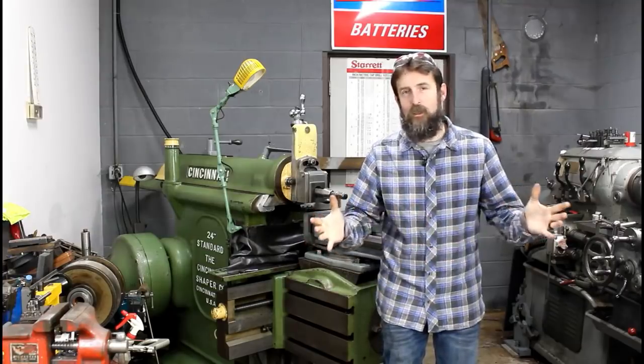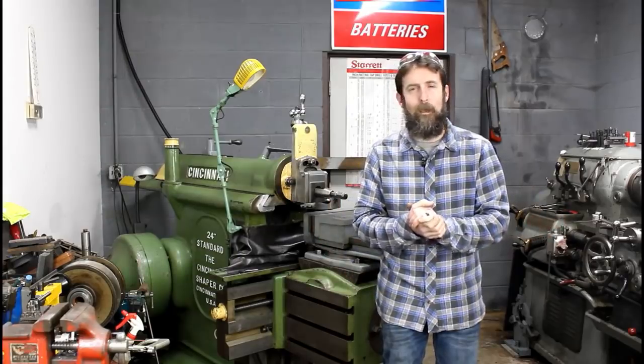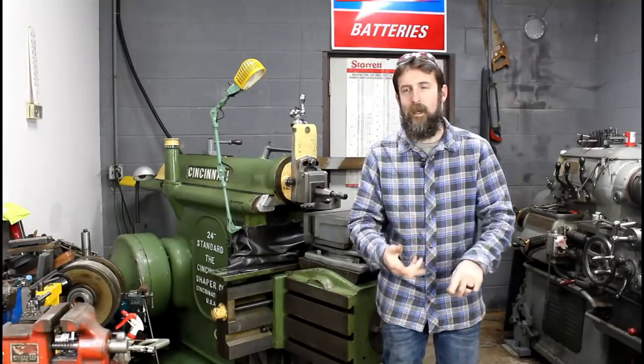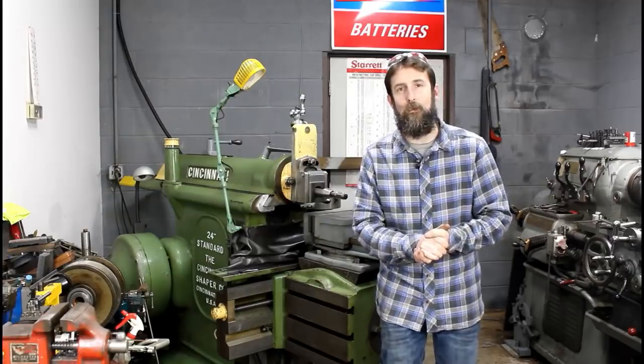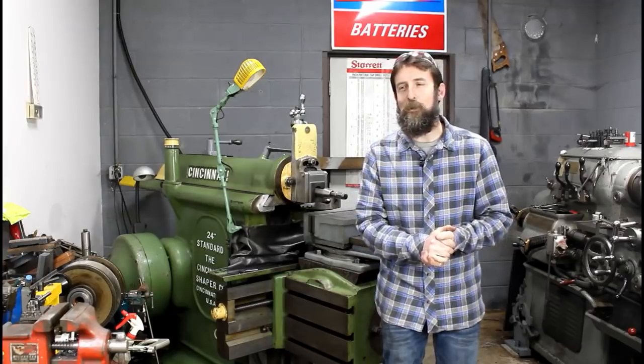We pull off the whole vise unit, remake the shaft that goes on the idler wheel for the blade tracking adjustment. Gotta remake that. Then we machine some pockets on the sliding vise jaw that are pretty hard to reach, and they use a pretty interesting tool to get that done. This project will never end.